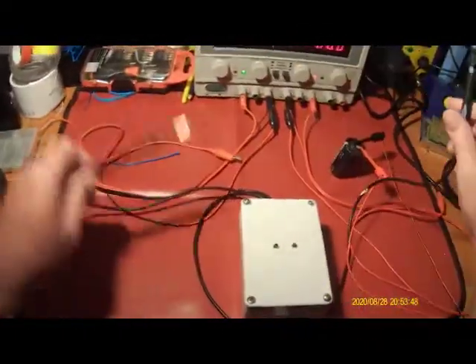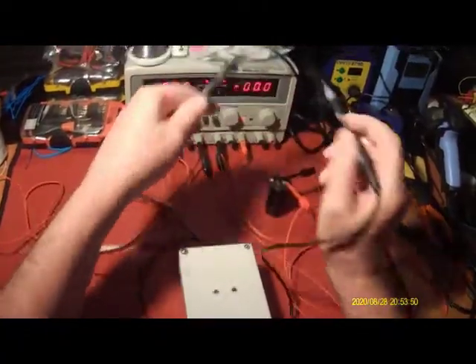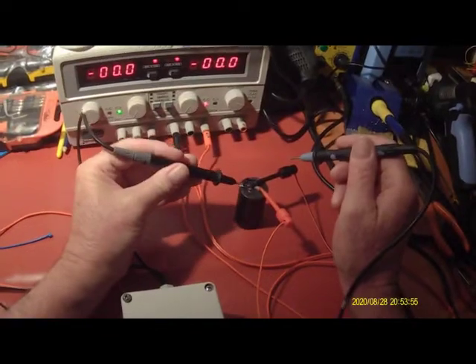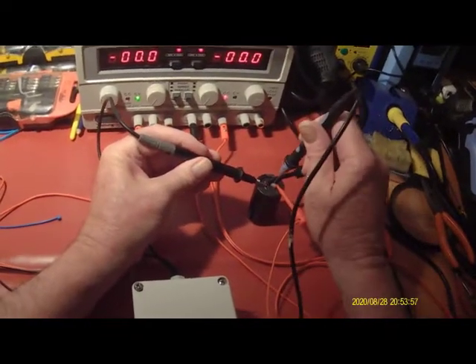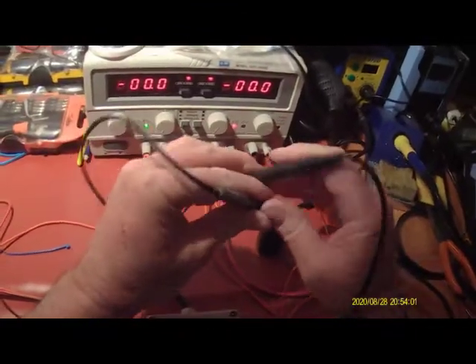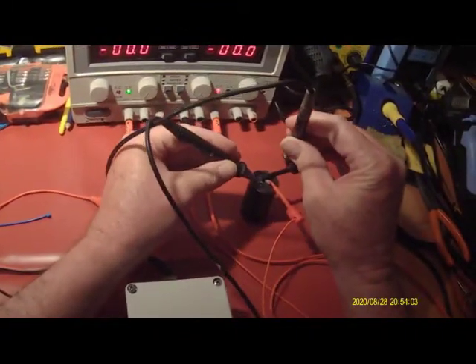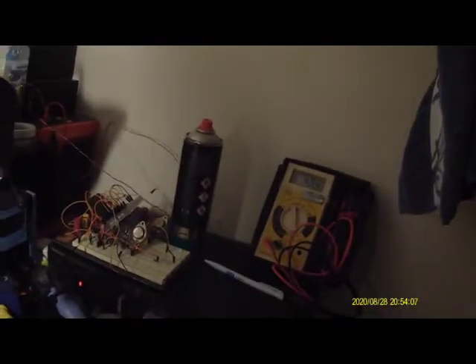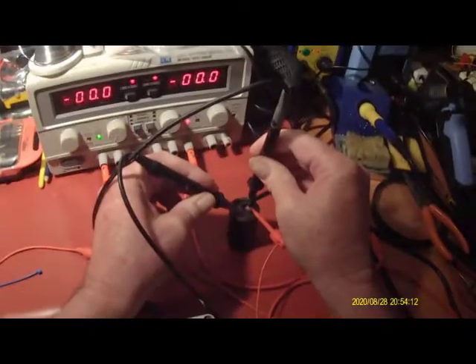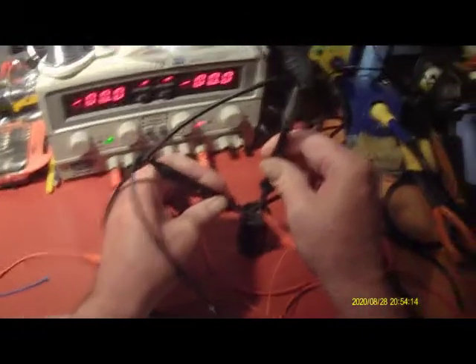Taking these any which way — get the light off it — and you can see that that one lights. If you haven't swapped around, it doesn't matter, because the other one will light the other way. Now you can see the exponential drop — standard exponential drop of a capacitor with time.